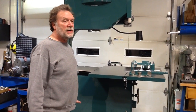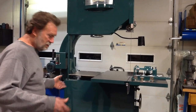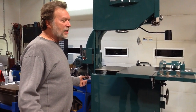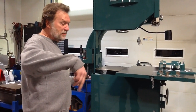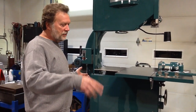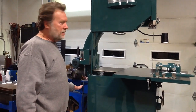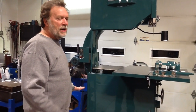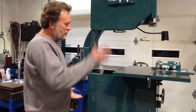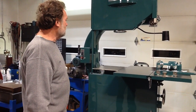I machined the tires. I did that actually on the Bridgeport. I spun them like a bus driver turning a big wheel, and chucked up a grinding wheel in the chuck and was able to true up the rubber tires on this thing with the proper crown, relief angles basically, plus or minus 3 degrees top and bottom, and then maybe a half inch flat in the middle of the rubber tires.